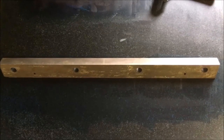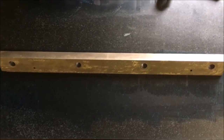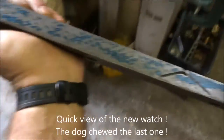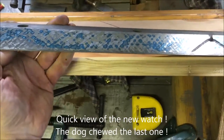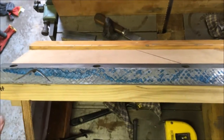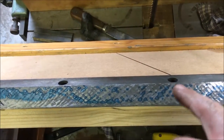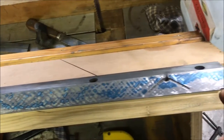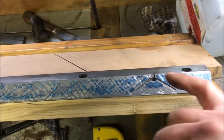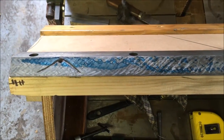I've found if you put too much ink on you can't see anything, and if you don't put enough on it's a microscope job. You just suck it and see until you find what works. Lift it off, turn it over. You can see where we get a print now - the high spot is moving out slightly. I think the edge contact is more to do with my rotating it, so I'm going to ignore that section until I bring the rest down a bit more. We're at cycle six next.